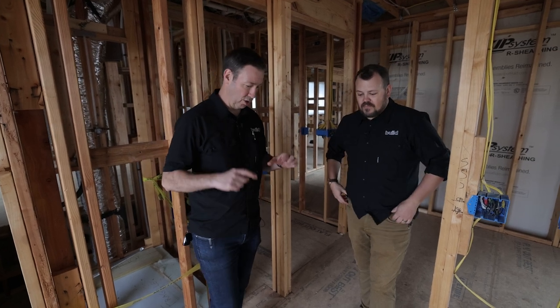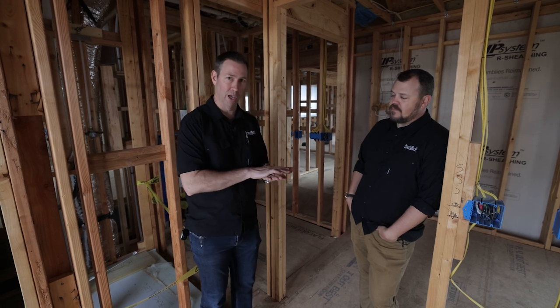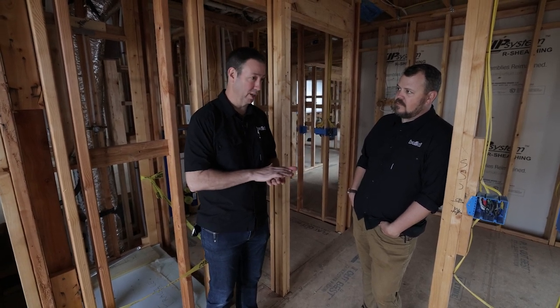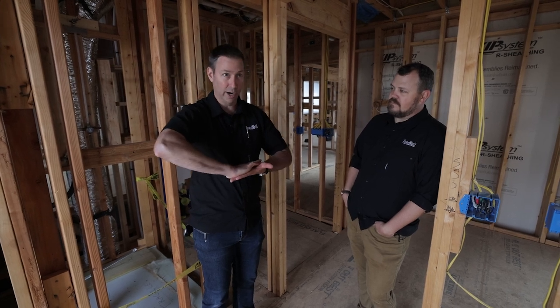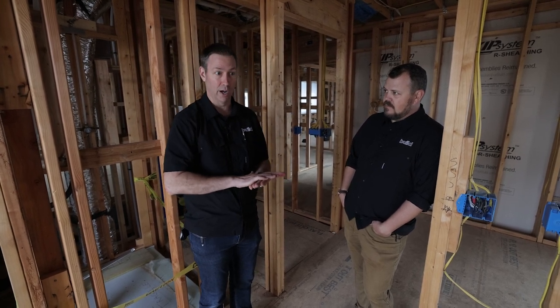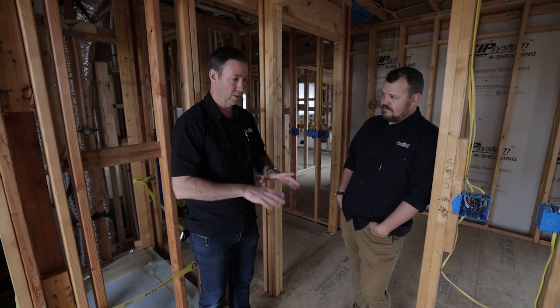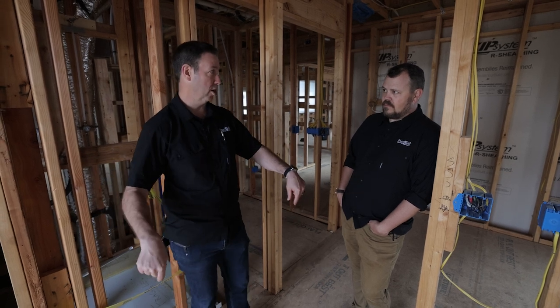And the builder's telling me this is R10 on top of the slab, so around 2 inches or so of slab top insulation. And then, as you mentioned earlier, two layers of 3/4 Advantech. Now remember, you got to put those opposite each other. They're not straight on top of each other. They're at a 90 degree angle to each other, and they're glued and screwed typically to each other. So this is actually a floating floor. We're not actually screwed down to the concrete.